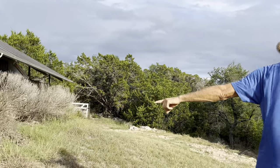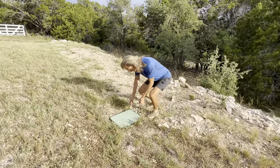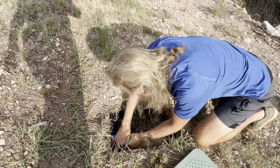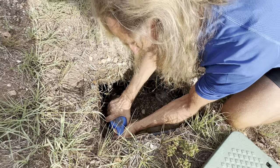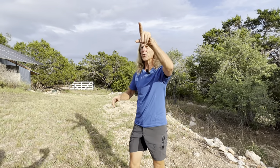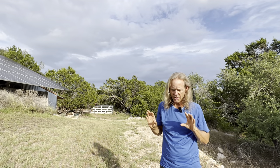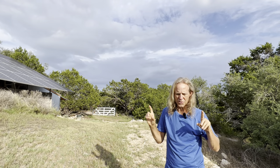At the low point there's a T and there's a drain line. This drain line has a four inch ball valve. It allows me to open this entire piping system and drain it out. And that's important because those pipes get sunshine down in them, and after a week or so in the sunshine with no rain, the water in those pipes starts to smell like an old pond.